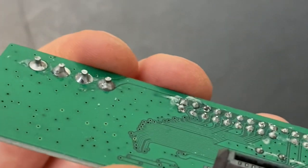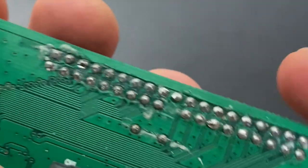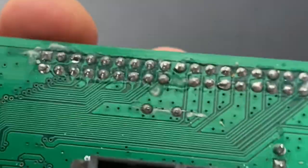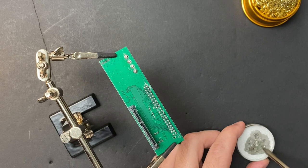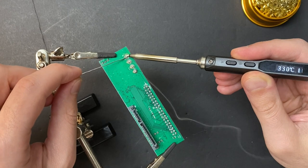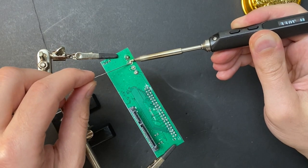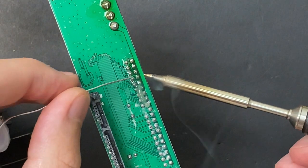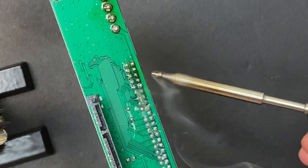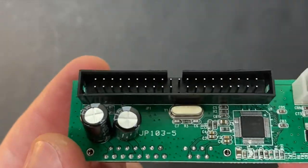As for that SATA adapter, this thing was in bad shape — cold solder joints, solder missing from about half the pads. I did pick a pretty cheap adapter so I wasn't expecting the highest quality, but this was a little worse than I imagined. Nothing that a little reflowing can't fix. The surface mount components look really good; it's just the through-hole components that look shoddy. I went over them one by one and about half an hour later I was pretty happy with how the connector looked.